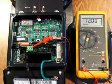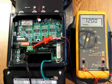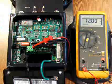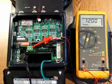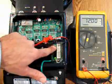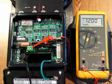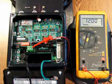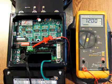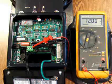I'll now review a few of the advanced controls within the master control unit. These two banks of dip switches are for configuring the torque and power outputs. There's also a series of rotary switches located here for scaling the power output signal. For more information, refer to our product manual. The torque output signal is now ready to be wired to your data acquisition or process control system.